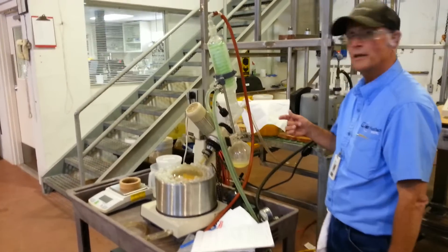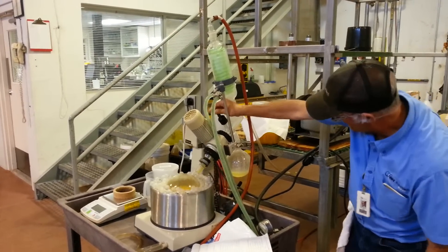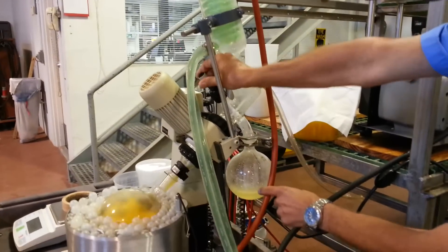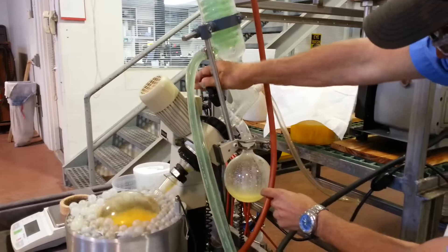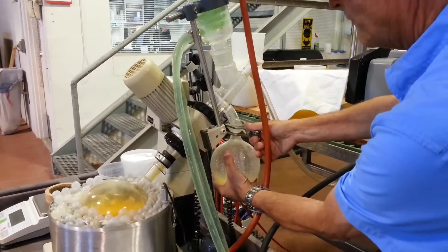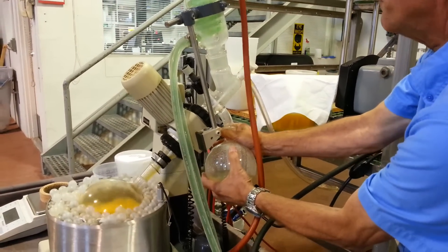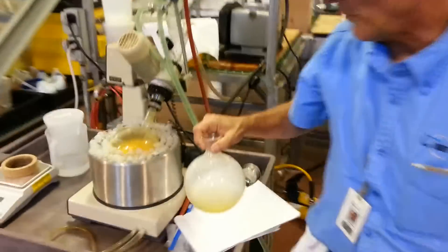To know what point you're concentrating to, what you need to do is close this valve right here until it shuts off the flow to the condensate collection flask. So that's what I'm in the process of doing now — just close it until it's nice and firm. You can unclamp the flask, make sure you hang on to it so it doesn't fall, break the vacuum, and then we can weigh it.